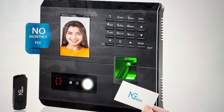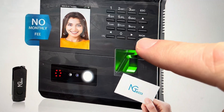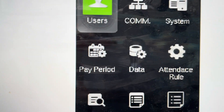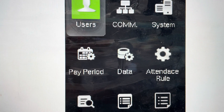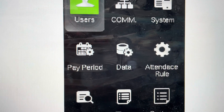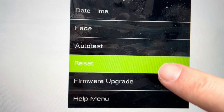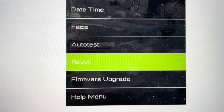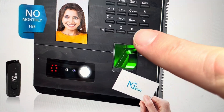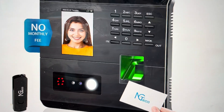So all we're going to do — the first thing is enter the menu by pressing the M/OK button with a long press for three seconds. That's going to open a menu, at which point we're going to select the System submenu. From the System submenu, we can go and select Reset. Then from the Reset option, we go back to our M/OK button, press that, and it will reset it to the factory default settings.